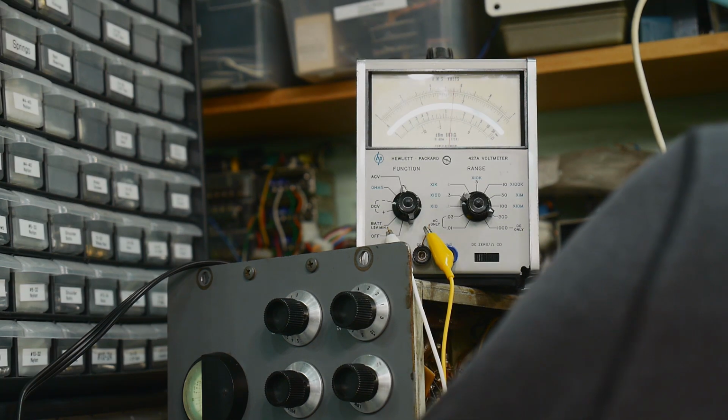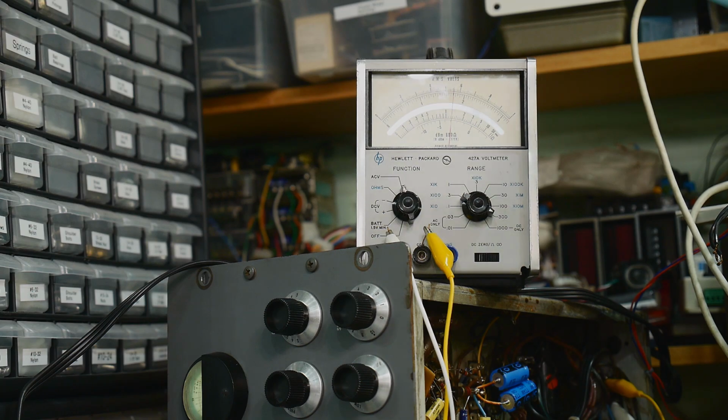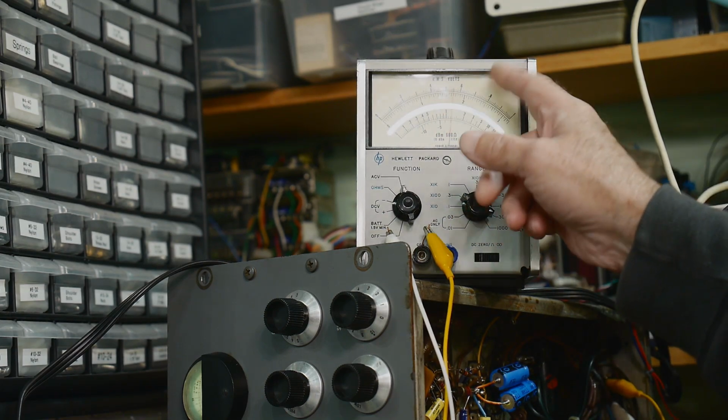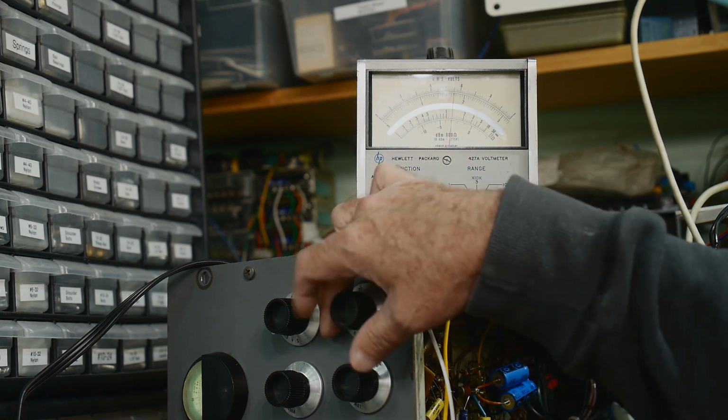Okay. And number 6 is not moving the needle much. A little bit. It was basically in a good adjustment also, so I like it so far. And then the other adjustments are on the other side of the instrument. So I think you get the idea though. It's a matter of peaking the meter every single time you adjust one of these. Peak the meter. Keep changing the ranges on your meter, or change the volume if you need to, or sensitivity if you need to.